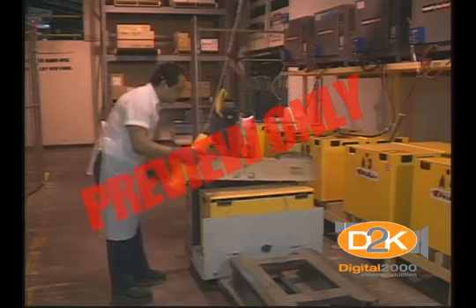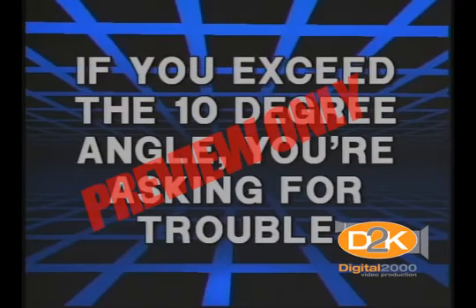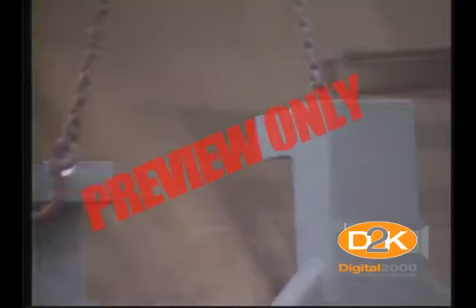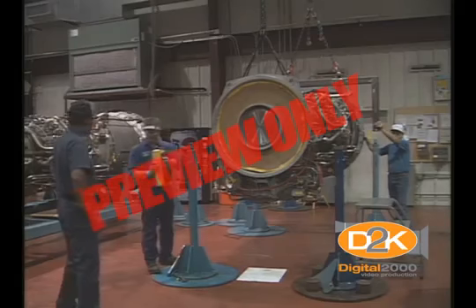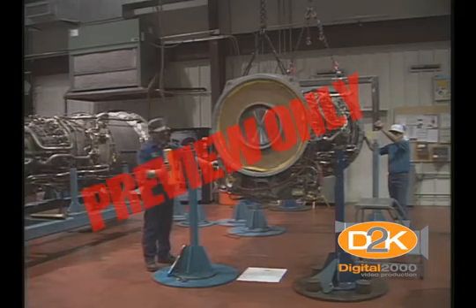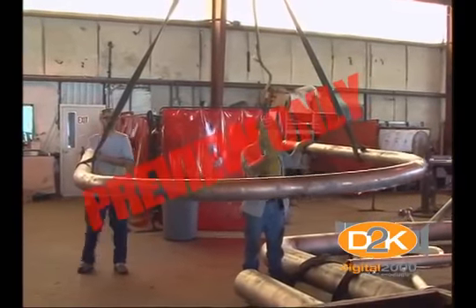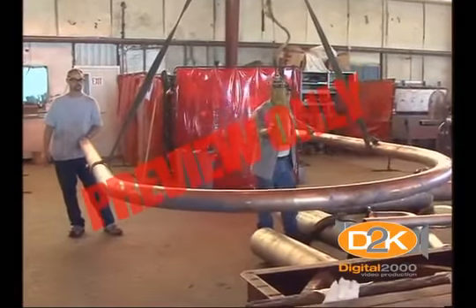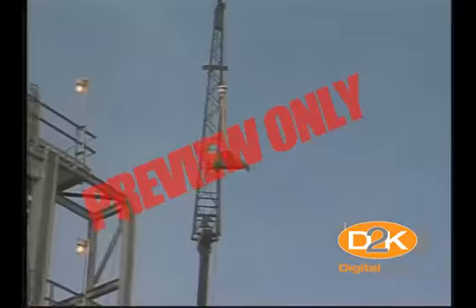If you must lift at an angle, don't exceed 10 degrees from the vertical — this is about the safest method of lifting anything. If you exceed the 10-degree angle, you're asking for trouble. If your crane or hoist is off-center from the load, it could start swinging from side to side when lifted. Make sure no one is standing nearby when you lift the load, and keep the load as straight as possible. When traveling with the load, always carry it as close to the floor as possible so that if it starts swinging you can stop it quickly.